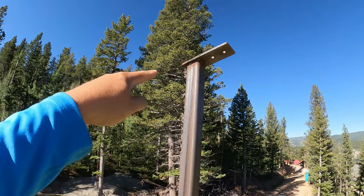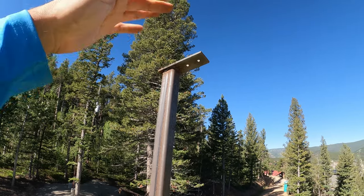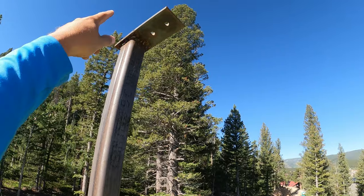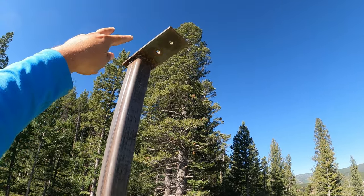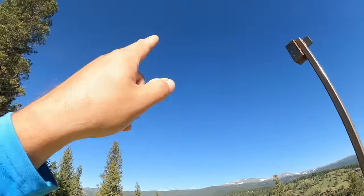Basically, you see the cut, the tab, and that's put at a 4/12. Technically, that's the height of the roof right here. And we will be running at a 4/12, and both top plates will be sitting above that steel, connecting all the way to the ridge beam.